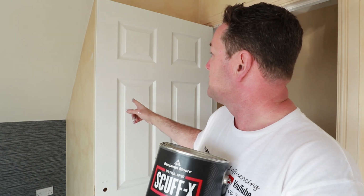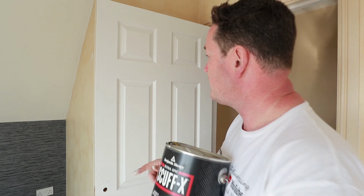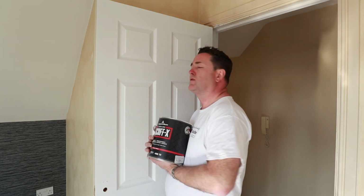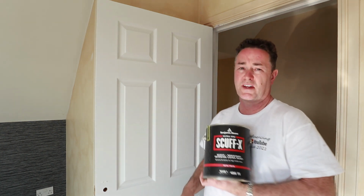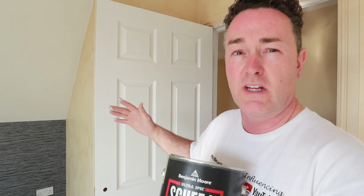And I have to say, I think it's covered in 2 over that 1, 2, 3 Zinsser. If I look with a professional eye, and I'm really looking, sometimes you can see previous brush marks or where your brush marks are drying out, it can be a bit deceptive and give you a false sense that there's shadow in there and it looks like it's not covered. But this door that's been done a couple of hours now, it's dry. I think I might be nitpicking to say that it's not covered. I'm quite happy with that. I'd let it go at that. I'm not questioning whether it needs a 3rd coat.